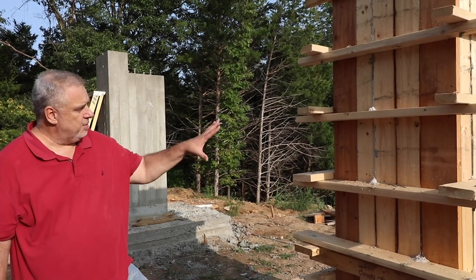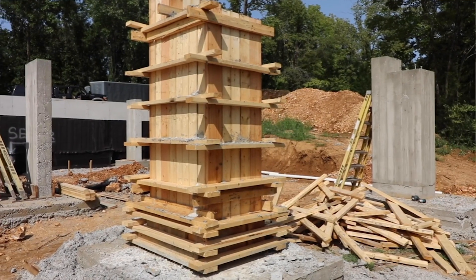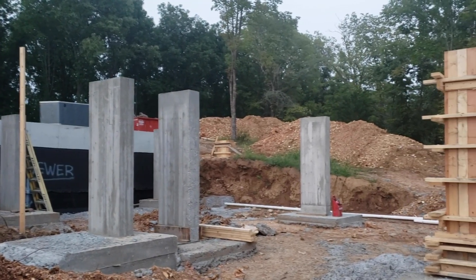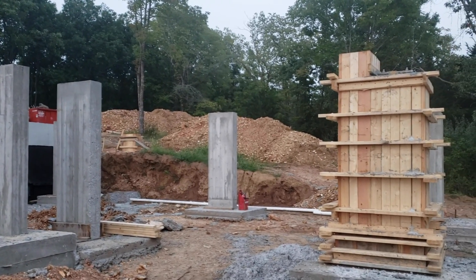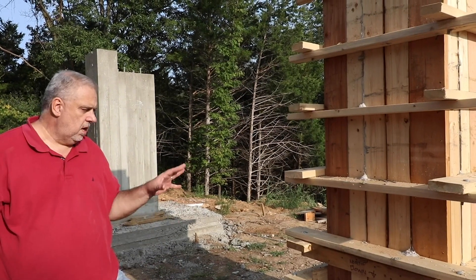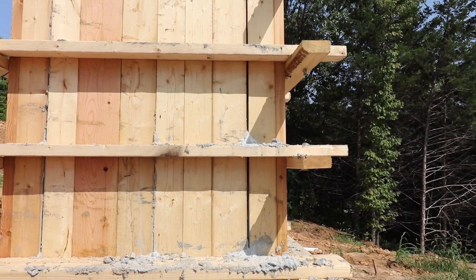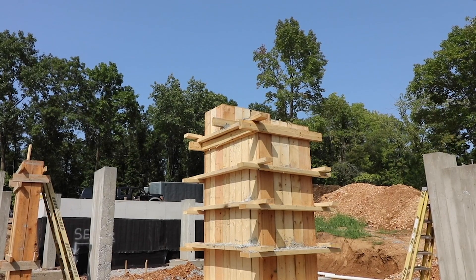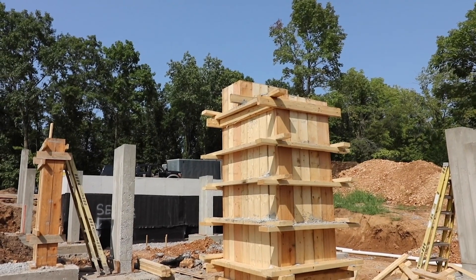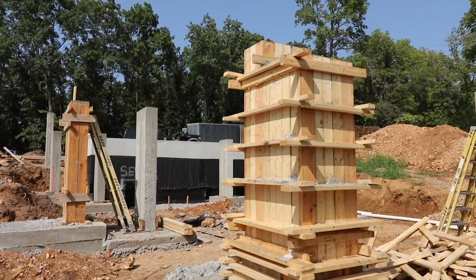It's a pretty neat foundation. You can see to my left there's a bunch of wooden forms — not necessarily your traditional foundation form. About 70 percent of the house in this project is sitting on top of concrete piers, so it's going to be basically open to the underbelly of the house, and only about 30 percent actually has a basement. When we were deciding what to make those piers look like, we came up with this solution of board-formed concrete. The boards are vertically oriented, various widths from three inches, four inches, and five inches, chaotically placed on the formwork to conform to the sizes of the structural piers themselves. You can see it's very heavily braced — a lot more bracing down at the bottom because you have all that weight of concrete above pushing down on it.